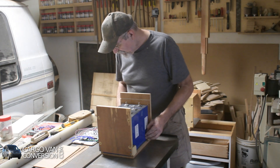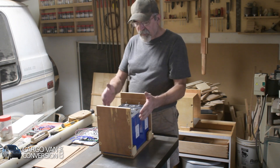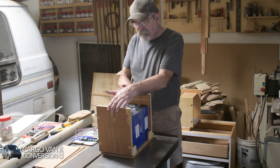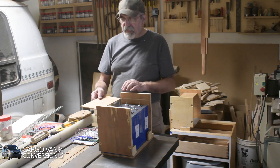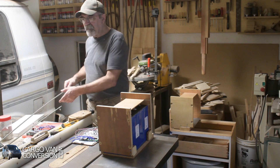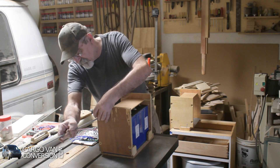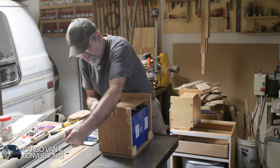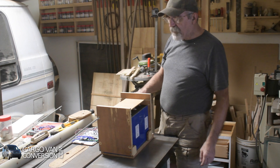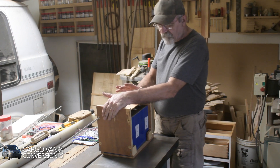It fits quite nicely. I made these in such a way that I can squeeze the top, because these battery cells tend to bulge when you're charging them and that should be prevented - they have to be kept together. I can put this separation in later on so the terminals are a little bit protected. I have four holes on each side, and with this rod and some bolts I can raise the tension and keep them really close together.